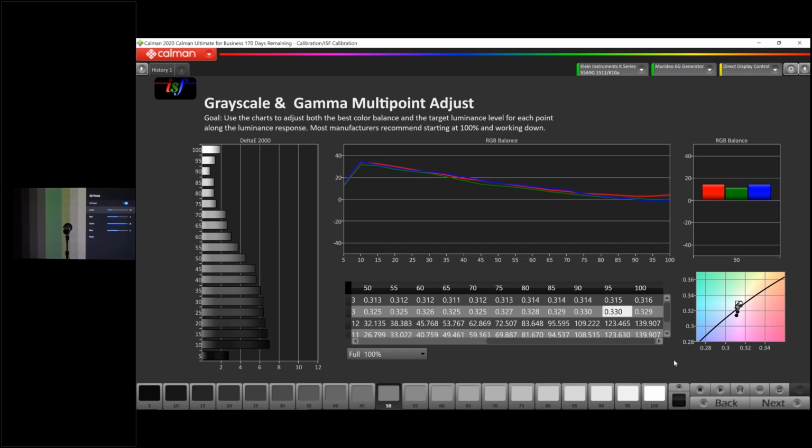So for you audio guys out there, think about this metaphor. Let's say you have an equalizer and you go to put some boost or put some gain into 1 kilohertz. But when you do that, it also boosts 900, 800, 700, 600, and 1100, and 1200, and 1300, and 1400, right? So these discrete controls are not very discrete, which makes me very nervous to use them. Let's go back down to 0. And let's see if those same bars turn magenta. And they sure do, and more than one of them do. So again, a little discouraging. I wish they had fixed this.